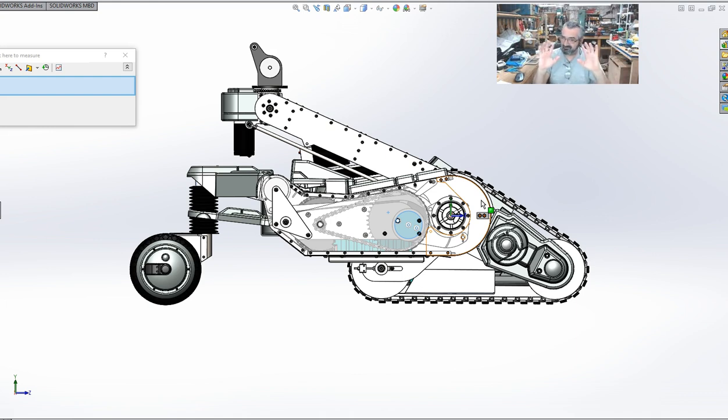It's not a magic bullet. We're only talking machining and parts fit, a little bit of this wiggles a little bit here, that wiggles a little bit there, all those cumulative things. That's the only thing that pneumatic tire pressure adjustment is meant to account for, not for, oops, I put a hole a quarter inch out of place in the wrong spot. Oh, it'll be fine. No, you're screwed. Go back and remake it. This geometry is critical. If it's not within a few thousandths of an inch, you're going to start having issues, and you're going to see it. So again, attention to detail. It's got to be right.